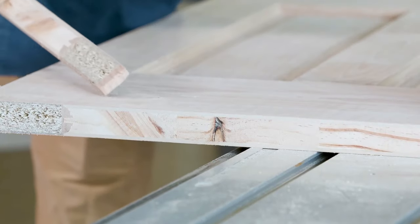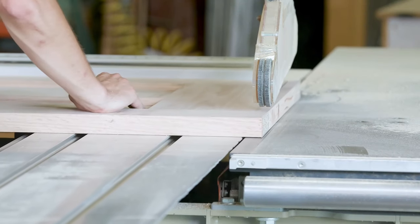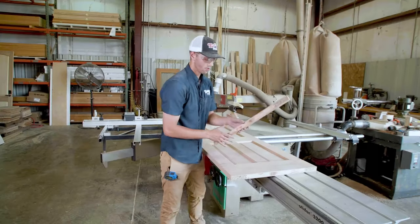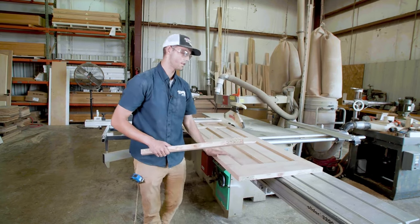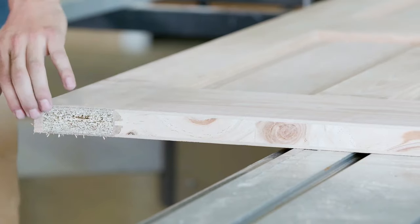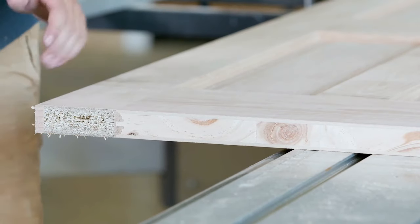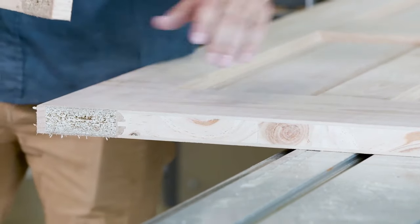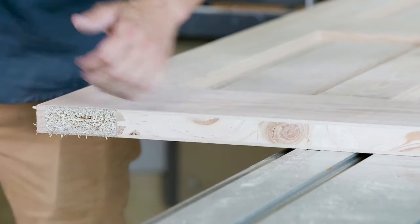If you're looking for a stain-ready, natural wood look door, let's cut into it. At the end of this door you can see the color change — this is probably pine, whereas the veneer facing is red oak. It's very difficult to repair because of the veneer facing; you can't sand the door down like you would a traditional solid door. Cutting further, the door looks the same all the way through — solid wood, but it's just not solid red oak.